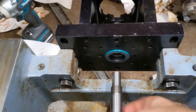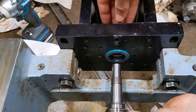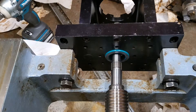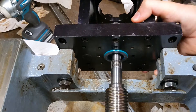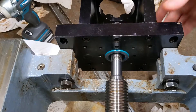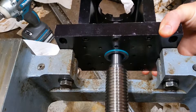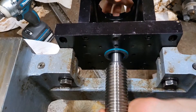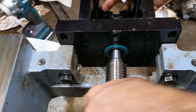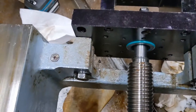Okay, here's what I've come up with for putting the ball screw into the thrust bearings. I'm not sure I should have the clamp assembly tightened down right now — none of this should touch until it gets here. I'm just spinning the ball screw and it's going through the ball nut, which is loose because there's a ton of play. I should probably try to have it relatively centered. Now it's pushing the table back, and since the camera's mounted to the table you might notice it moving slightly.